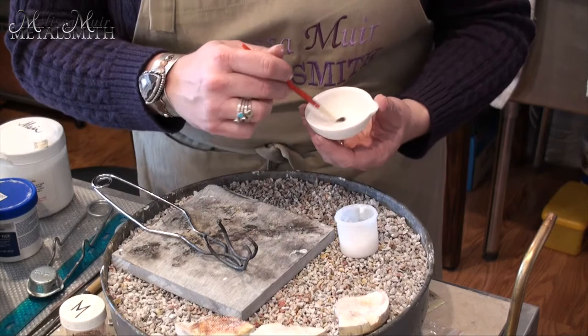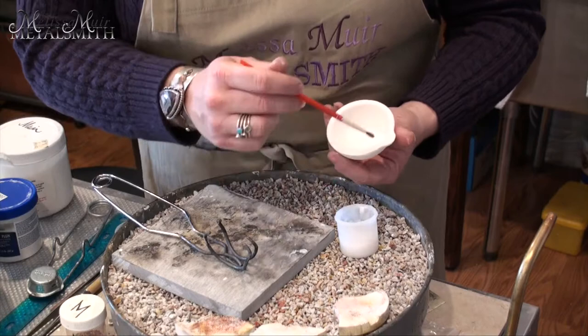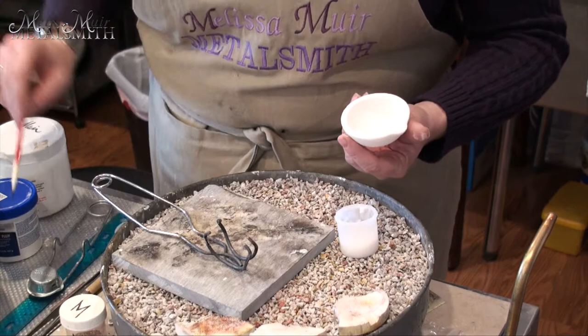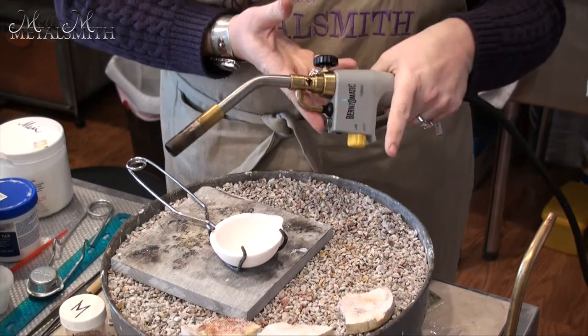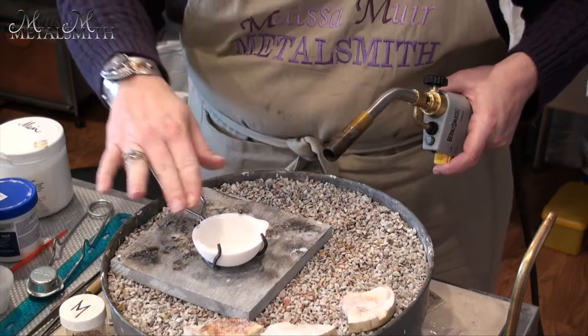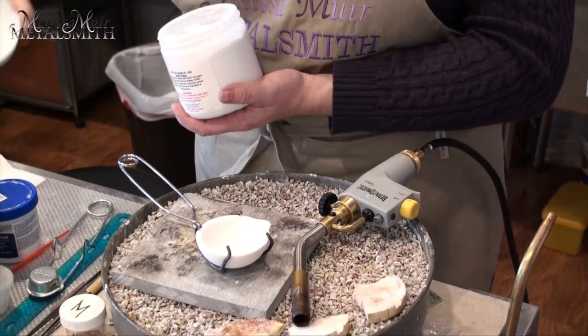Now I have a really good coating, and if I come back and add a little bit more, I can see it's not soaking in quite as much as when I very first started painting it. I really want to make certain that this pour spout is nice and coated. Now I'm going to put this back into my whip — this allows me to hold onto the crucible without actually holding onto it. I'm going to use my MAPP gas torch, which I really like for any kind of casting or big metal meltdown. I'm going to heat this up, and then I may sprinkle some boric acid into it or repaint any areas that need a little bit more.